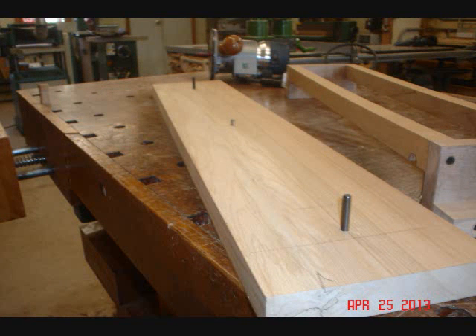The first thing that I made is this board, which I'll refer to as a stage. You can see in the photo that there are three steel pins put in this and they're in a perfectly straight line. The center pin, which is the shortest one, looks like a little kind of a black dot, and is placed there so that the disc that I'm going to do the work on will be rotated around that pin. It's going to pivot on that, and the pin close to you and the one at the far end are going to be used to register that frame that you see on the right of the photograph.